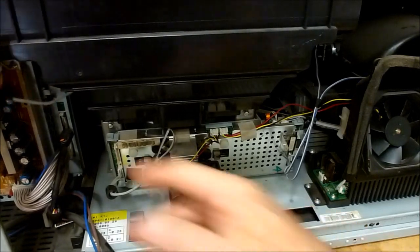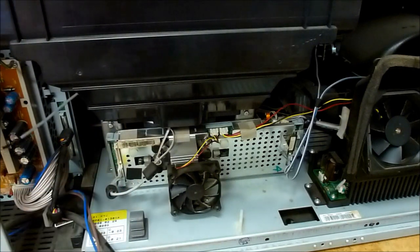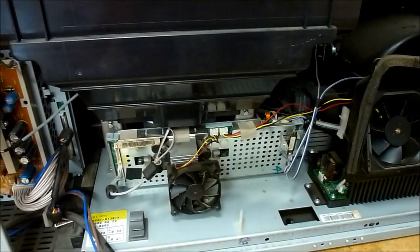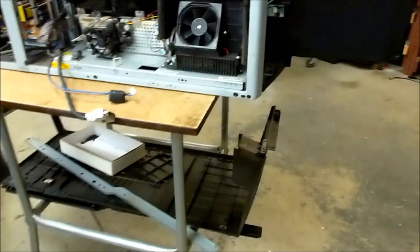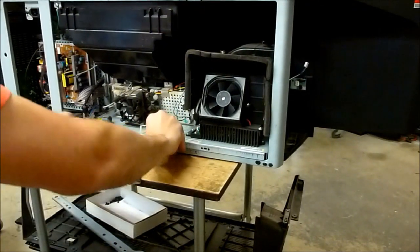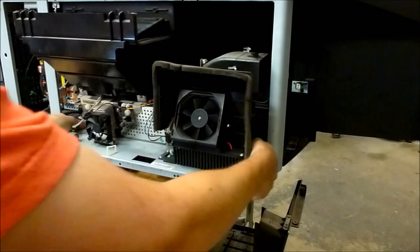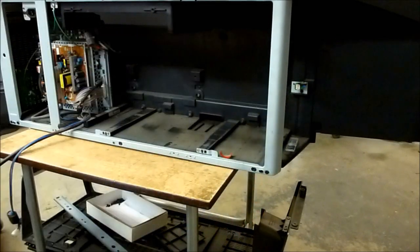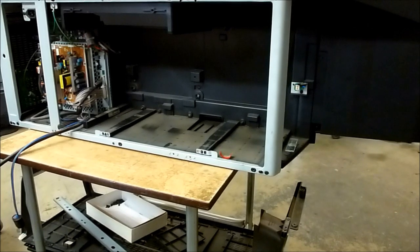Reach in and unhook the remote control receiver cable that I was telling you about. Make sure that you've got the light engine or the door safety switch disconnected. Once you've got all the screws out of the engine, it just pulls straight out, and we can just push the set out of the way at that point, and we'll concentrate on the engine itself.